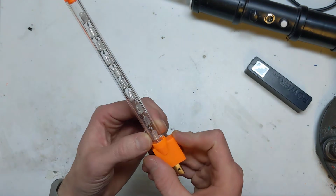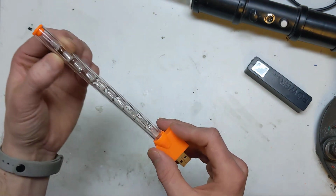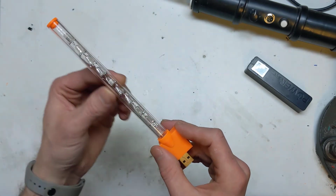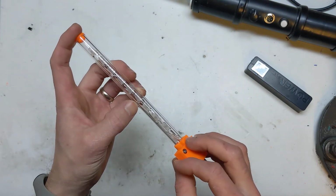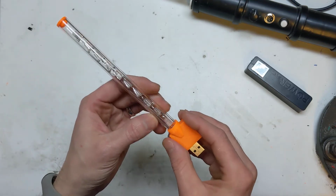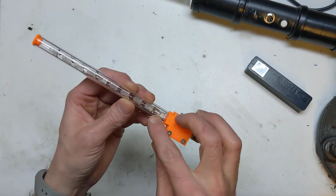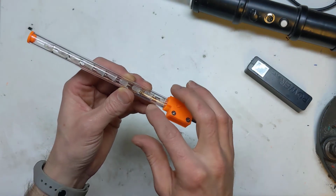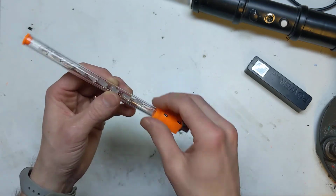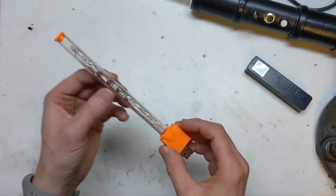What I've done is similar to this other build, attached kind of like a circuit sculpture. I had two bus bars going down the side. This time I used Ethernet solid core wire, which worked quite well. I just had one for ground, one for power, and then the data in, data out pins are just soldered so it goes data out to the next data in, and just snakes along like that, which is quite nice. But it was a super tight build.